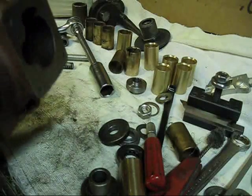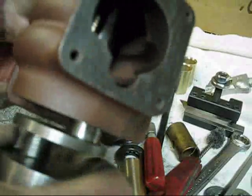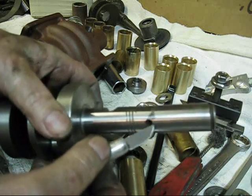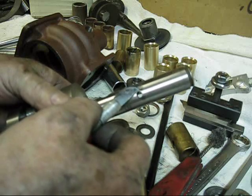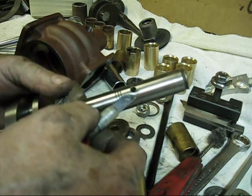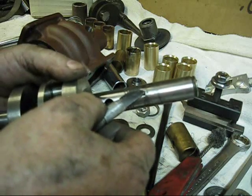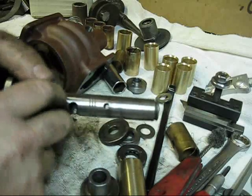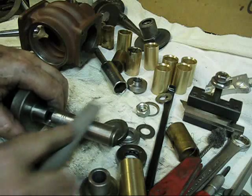We'll try it again and see what we've got. I've not put any oil on this yet because I want a real nice fit, and I can feel it's not right. So let's look at it again. You can see it moved over just a shade, but it did change color and it got wider, so I did make some progress. But there's a high place right there - see that shiny place between those two dark places? That's where I have to file. Should be on the other side, and yes it is - right there is the brass. I have to work that down and I don't want to take too much at one time. This is one of them things that you sneak up on. I'm going to go through that same procedure again and work just ever so gently.